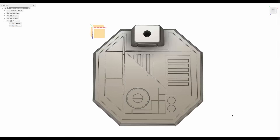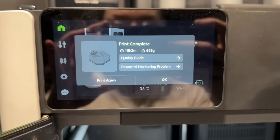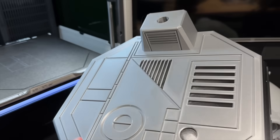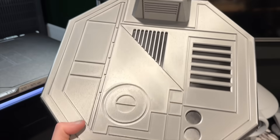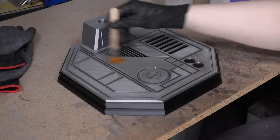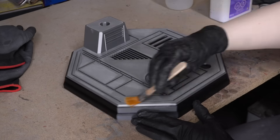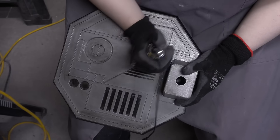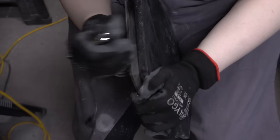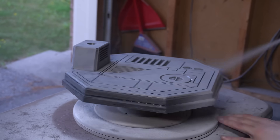The final FDM part that I needed for this droid was the base. I decided to design my own, which I will link somewhere in the description box if you want this for your own seeker droid. So I got that designed and then printed also in ABS, which meant I could do my usual MEK maneuver to smooth all of the layers out. I wasn't entirely sure how I wanted this painted, so that is why I did the whole sanding process on this as well. This obviously could be printed in a particular filament color to leave as is, and I did a couple of rounds of filler primer on this base too.